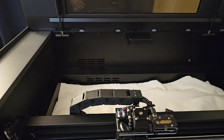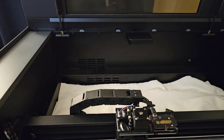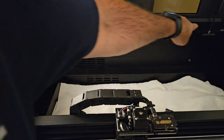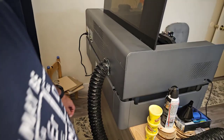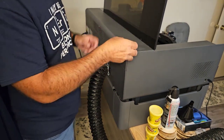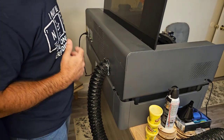There's one last mirror in the back. To get it, there are screws — remove six screws on this side, then go around to the other side where there are five more screws. This whole panel pops off and right in there is the other mirror. Pop it off — it's magnetic — clean it with a Q-tip, pop it back on. You're good to go.